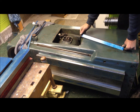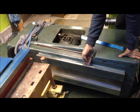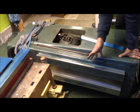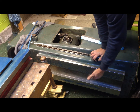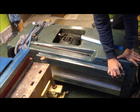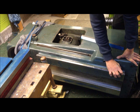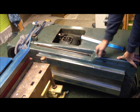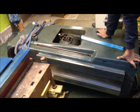Maybe that's not good practice, I'm not sure, but I guess that's how it was done — that they ground these. Of course, this place was ground, not scraped. The mating surface is scraped yes, but this one was ground. So I also could try to mount some contraption on here and grind the ways underneath, or make some kind of sled with the scraping tool underneath. I'm not sure. We'll try it this way first.